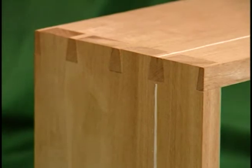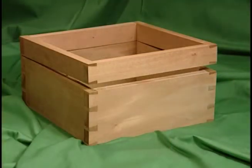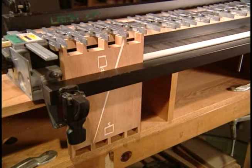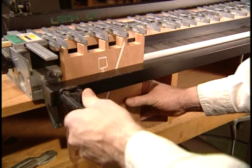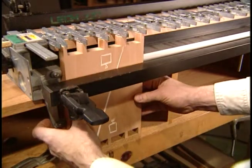In this case, one pin is made wider for a saw-cut allowance. So the half pins on both lid and chest will all look the same width after the lid is cut off. You can see that if both ends of the board are cut under the same asymmetrical guide fingers at one end of the jig, the wide pins at opposite ends will not line up.